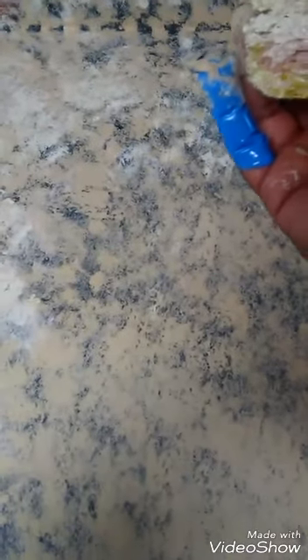I like that in some spots you can see more black than others — that adds character to the faux granite. I'm doing the same thing with the lighter color, going in randomly, and once there's less paint on the sponge I go back over it dabbing it all around, but not putting as much as I did of the first color. One trick about doing faux granite is layering the product, which I'm going to show you when I do the veins.